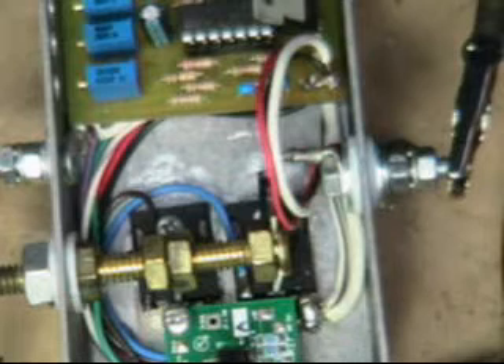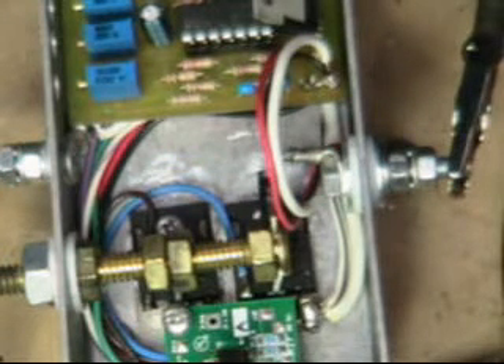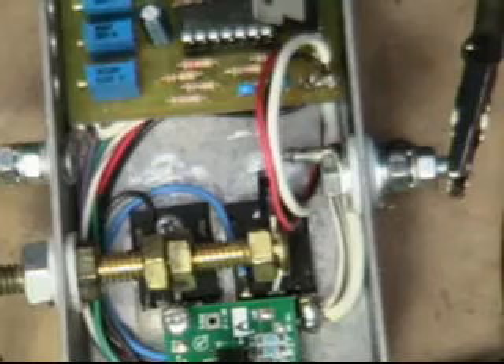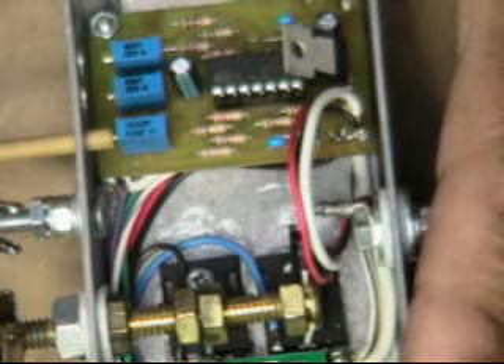That whine — I'm going to try to help people out maybe a little bit if they don't know what frequency is. That's what you're hearing in that motor. That motor seems to amplify the frequency. I'm going to adjust the frequency pot, which is this one right here. You'll be able to hear this as I adjust it. It doesn't change the speed of the motor — it changes the frequency of how many times that's on and off. That's what you're hearing: the amount of time it's switching on and off in a given amount of time.